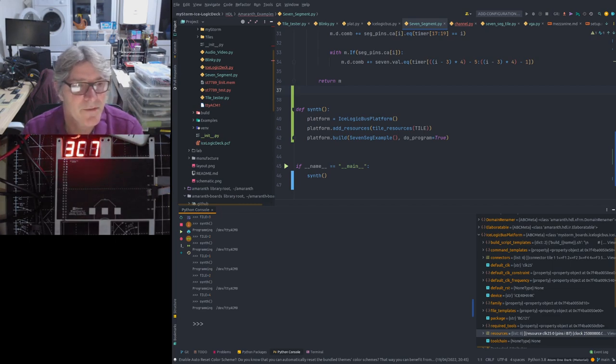Yeah, as I said, the ESP32's coming off. I don't want an ESP32 soldered on there. I want that to be on a blade card, or whatever we decide to call this thing. There's a couple of good reasons for doing that. One is we can change which Wi-Fi we use, so we're not tied directly to it. Secondly is you don't have to decide when you buy it, which we do with the current mini configuration, because it has to be soldered on the board. You can't do that easily yourself. You have to reflow it on the board.